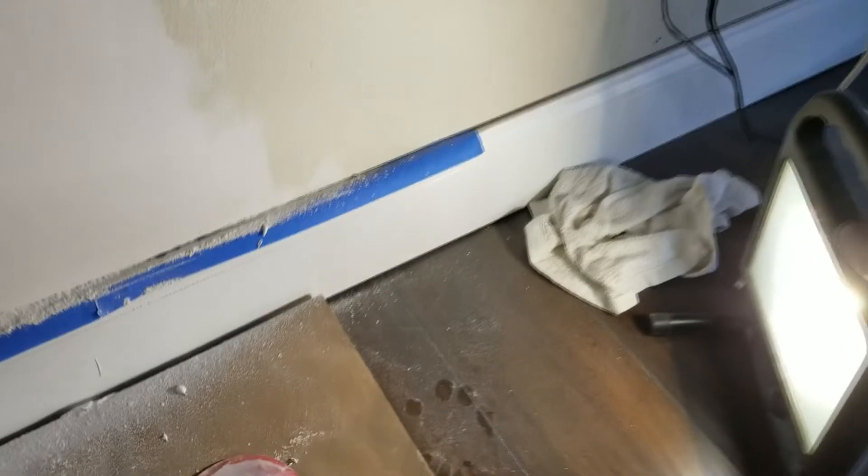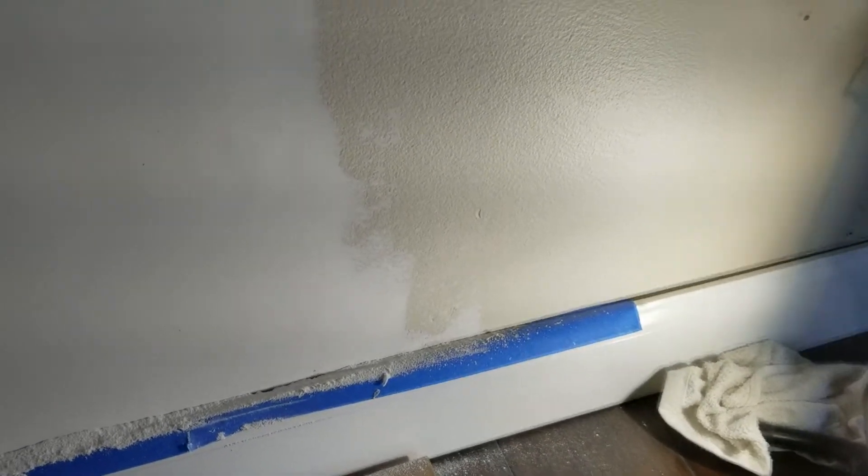So now that we've given it a good sanding with our orbital sander, I like to take a bright light and set it at a steep angle — just real close to the wall so that the light is almost parallel with the wall — and it'll show all of your blemishes. We'll just get them and sand them down as we see them. This is sort of how they do level five inspections: the inspectors come by with a light to look around edges and find any bumps. So that's what we try to do — sand them down.